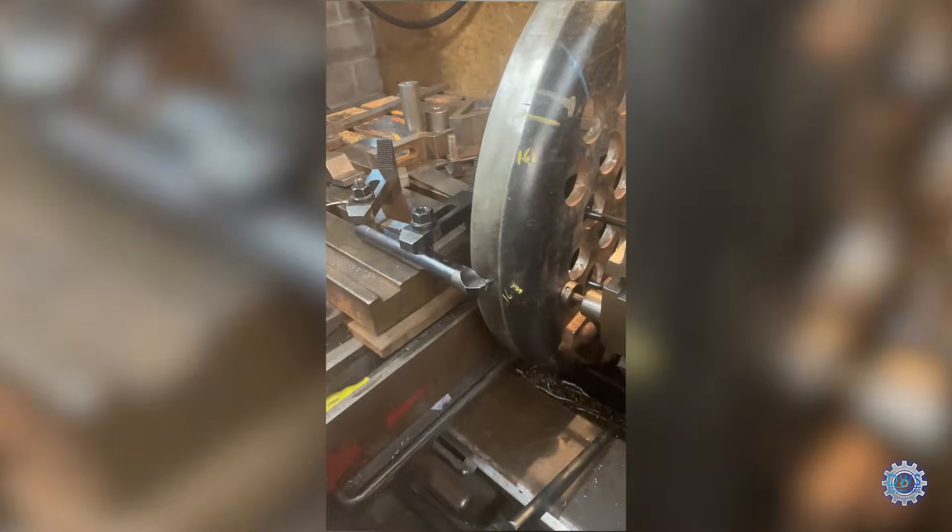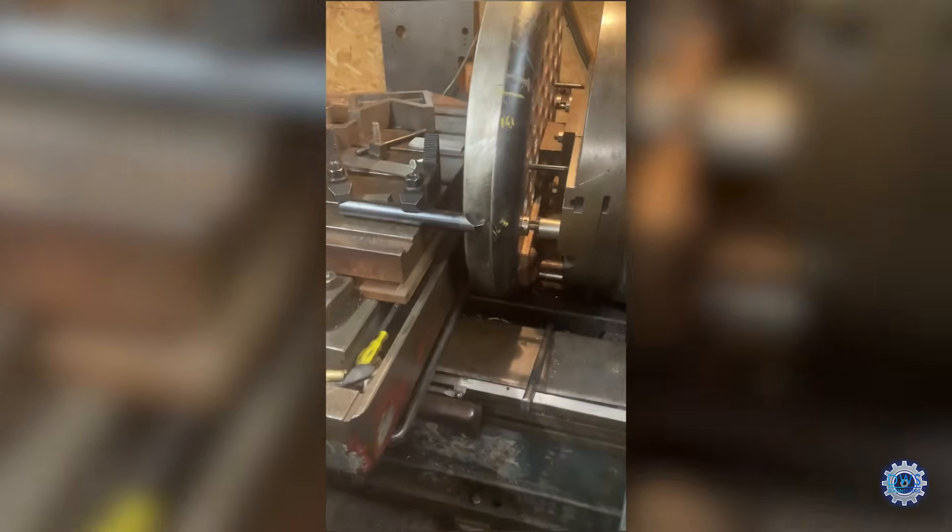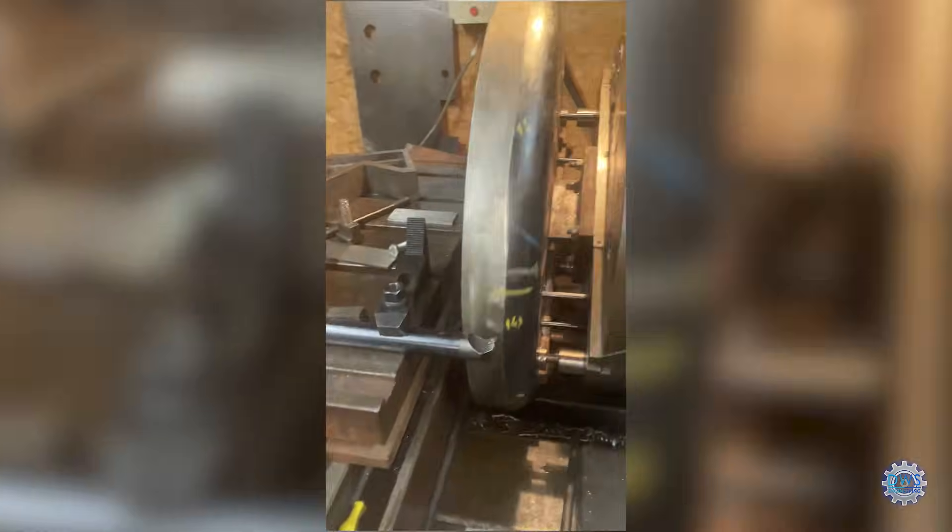Next I had to get it mounted up in the boring machine because I didn't have a lathe big enough. I had to skim about a millimetre off the outside to get it to fit. But this works quite well.